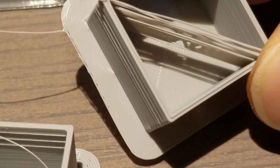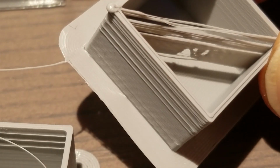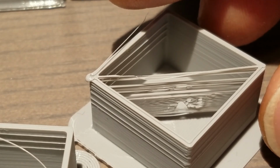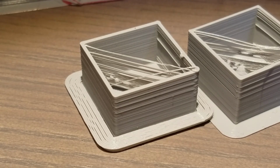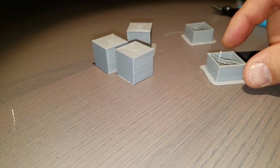If you look inside of it, for a portion of the vertical line, there is no diagonal line as the nozzle travels to start a new layer. The wall starts chattering. There's chatter in the printout, and there's no reason for Cura to start changing the way the G-code is laid out, because nothing changes throughout the phase.